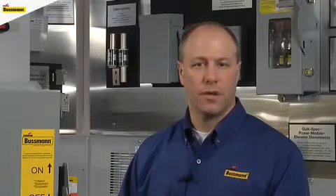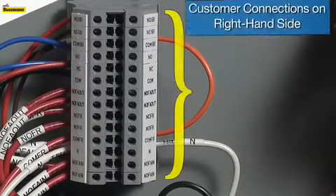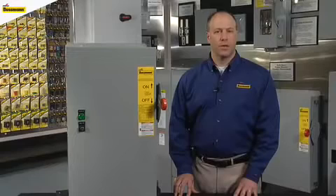Each of these two configurations will accomplish the same goal — they are simply different product models. Connect the two signal wires from the fire alarm control panel to the two points on the customer side of the connection block. The shunt trip signal is looking for a closed signal across these two points, which will enable the hydraulic valve system for a battery lowering device. The elevator control panel programming will then take over and bring the elevator to a predetermined safe floor.